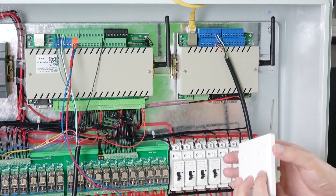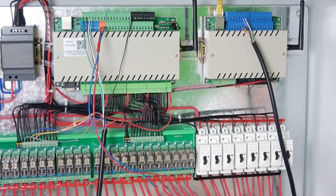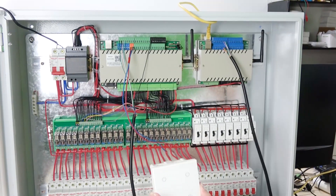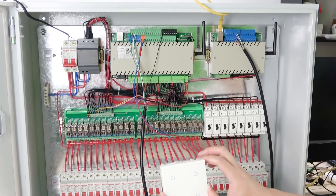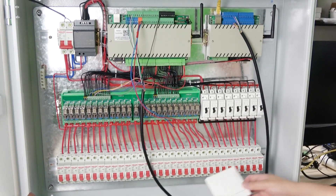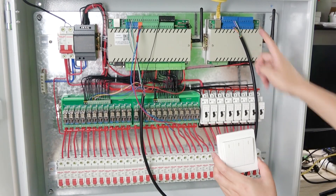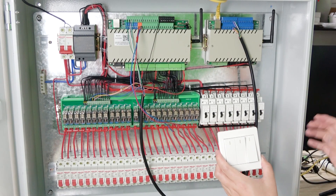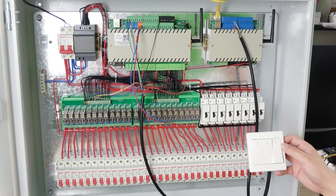This is how to wire the old switch. But most of the time I suggest you use the touch switch. Because with the self-reset switch, you can use many wall switches at the same time — if you have two, three, four, five instances of the switch, just connect them together, and every relay output can be controlled by many buttons. But with this old lock-type switch, you can only use one per input. So I suggest you use the touch switch — it's easier.